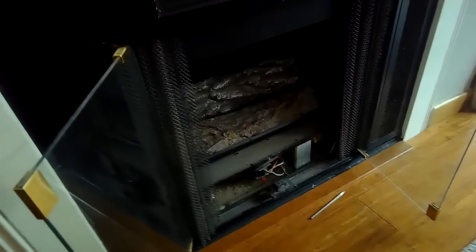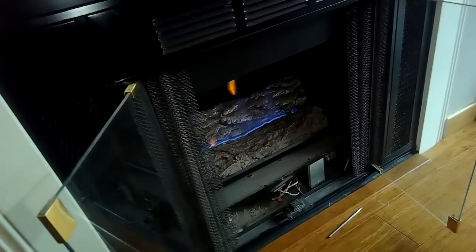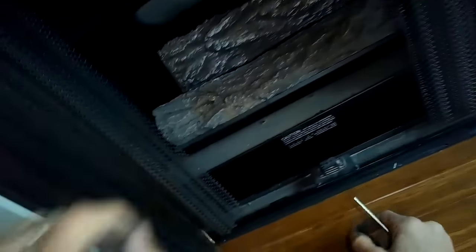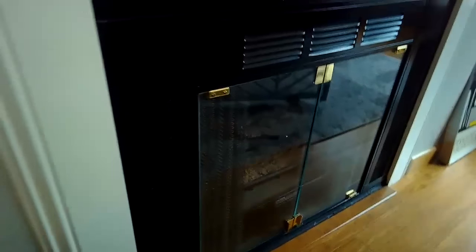Got a nice spark — there's the flame, there we go! So that worked — just cleaning things did the job. I'm putting the inspection plate back in; it just slides into position. I'll close it up and make sure that with a little bit less oxygen everything can still light. You really just need a wire brush to do this and then something to help open up that pilot hole. I turned it on and in slow motion, there's our flame.